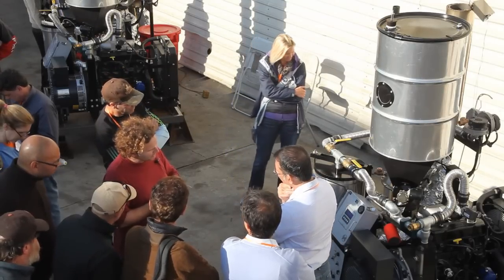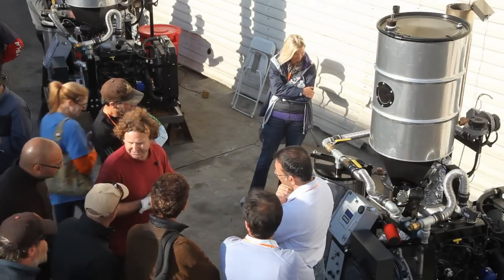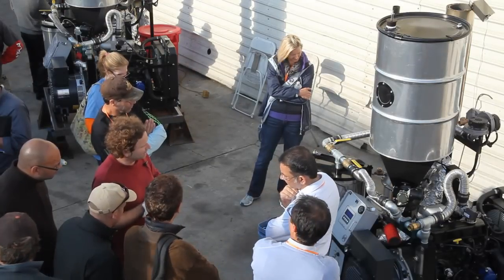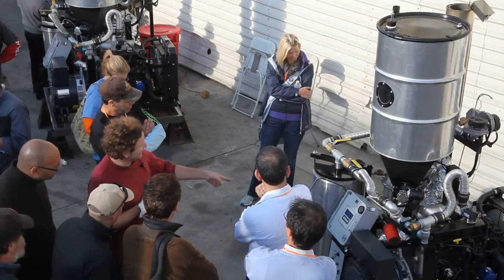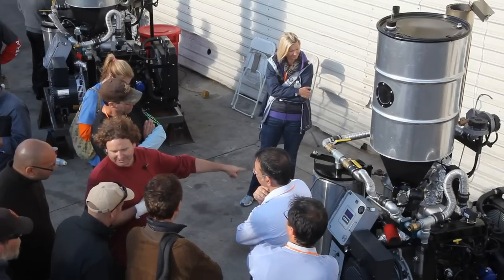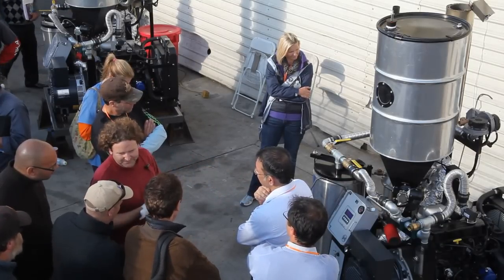The volume you would need for a buffer is very large. It can help, but in some ways it's just delaying whatever the problem is in the reactor from getting to the engine — you're going to end up with that issue regardless.